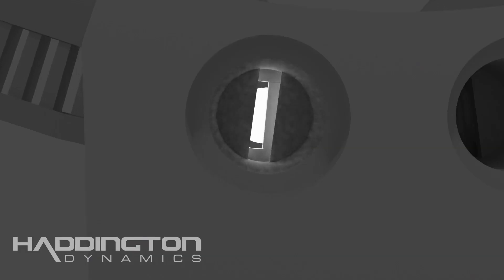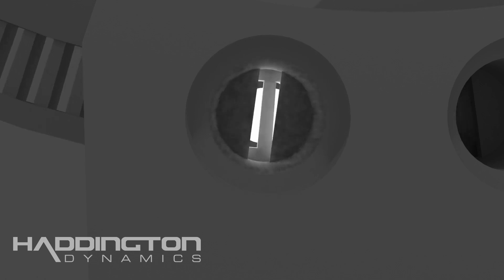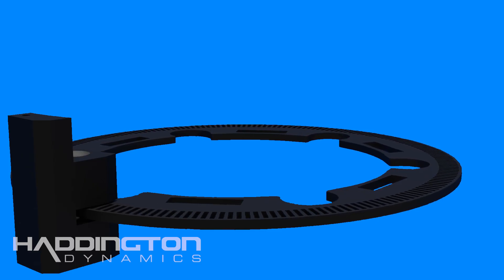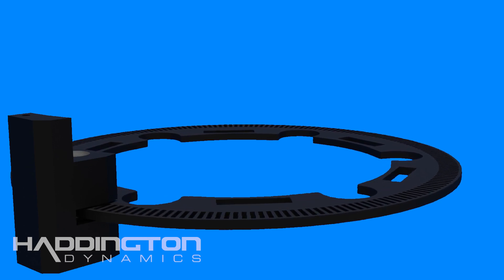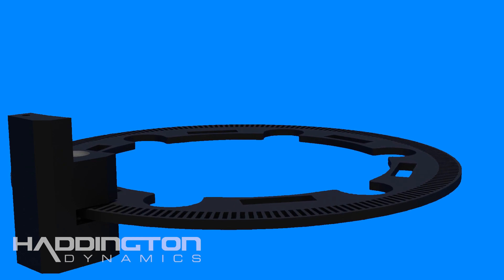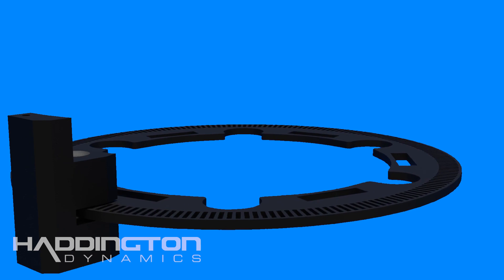The system is based on a quadrature encoder, but is modified to include more data points along each axis. An optical encoder traditionally involves an LED, a receiver, and a code disc with slits along the outer edge. The light shines through these slits with the receiver on the other side, counting the times that the signal switches between on and off.